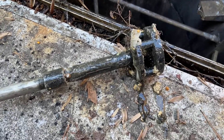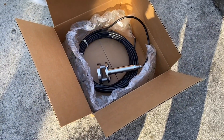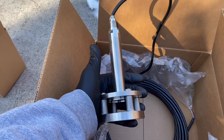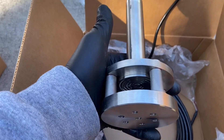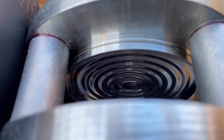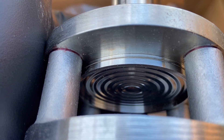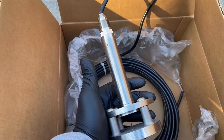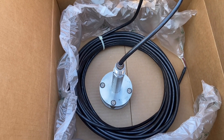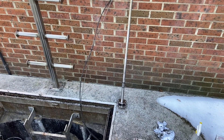This one isn't rebuildable, so let's break out a new one. They call this a birdcage-style transmitter because of the little cage on the bottom. All it does is measure pressure — that little diaphragm is the actual sensor. This is a 15 PSI transmitter, and at 27.7 inches of water per PSI, that gives us about 415 inches of range, which is plenty for most of what we do.